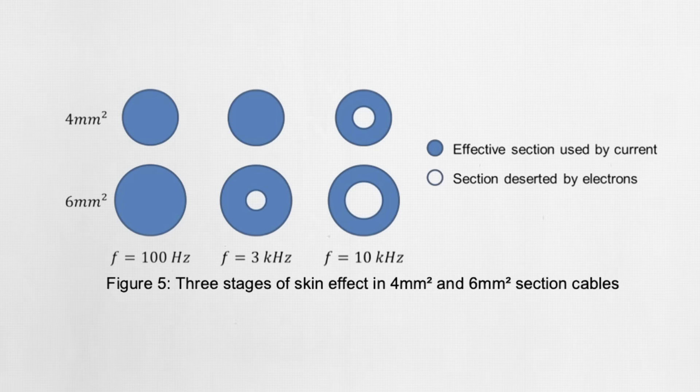As we've discussed, thicker wire has less resistance than thinner wire. However, when it comes to audio and alternating current at higher frequencies, there's a point of diminishing returns for super thick cabling. At higher frequencies, current flows near the conductor's surface — a phenomenon illustrated in the L-Acoustics paper. This tells us that thicker wires don't proportionately improve high-frequency performance because the high-frequency currents don't necessarily utilize the full cross-section of wire.